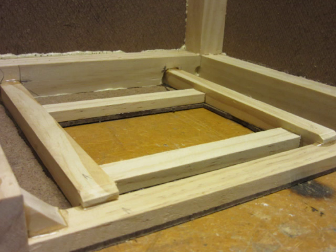Because all these hardware cutouts are just made in the masonite, you don't want to stress the masonite. It's in the semi-monocoque structure. It needs supportive stringers in conjunction with the strength of the masonite to have the adequate structural strength for the whole thing. So wherever you've got these cutouts, you need to glue in some wooden strips and thereby provide support.